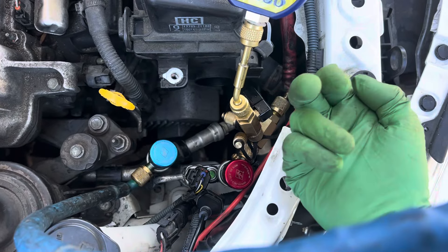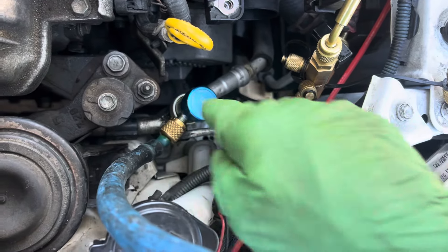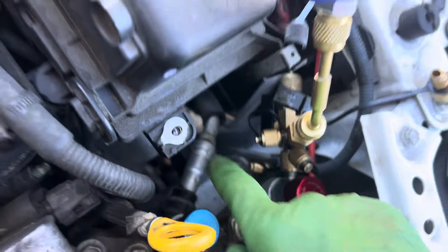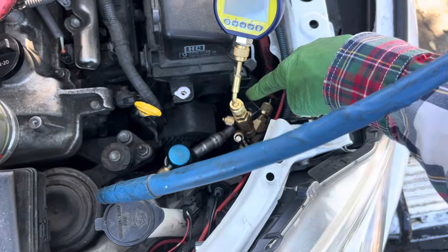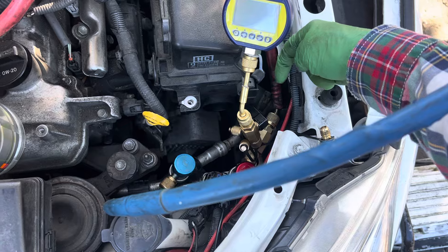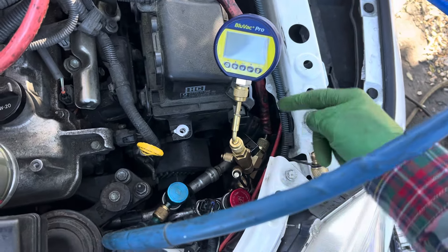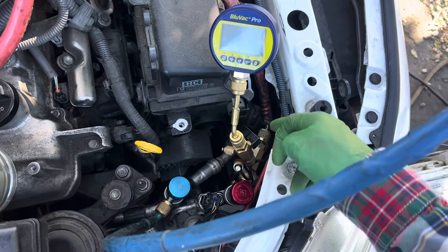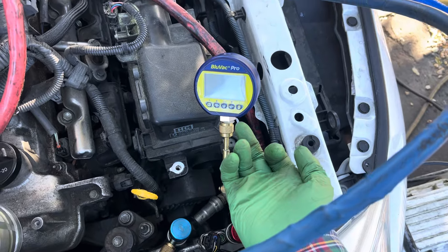When you're taking the vacuum, of course you'll have the valve in the up position — whether recovering or pulling vacuum on both high and low. You can see the other ball valve down here is in the open position because I have it open to the gauges — I charged it through there. But before charging, this is an important thing: you turn off your ball valve to protect your gauge, because you don't want oil and refrigerant getting in. The oil is the bad part; the refrigerant is just a carrier for the oil. If you charge with the valve open, oil from the refrigerant will go right up inside and coat your sensor.